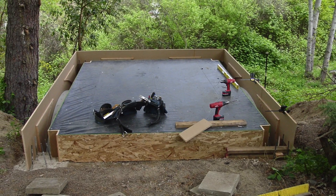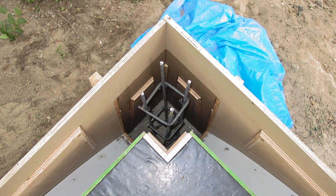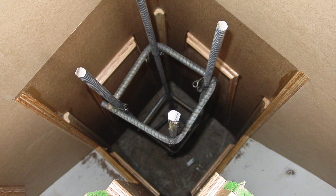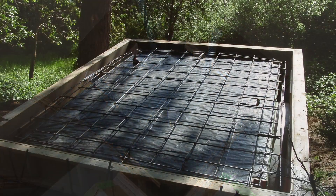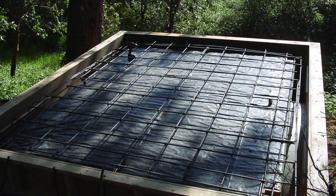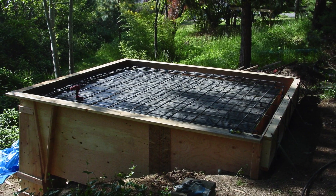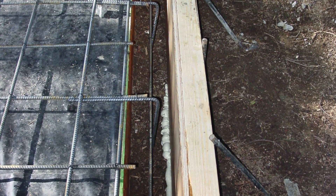We're at a point here where it's almost complete — just have to do the front portion. Here's another view of the rebar down the center of the pillar legs on the lower side. I had to make sure they didn't hit any of the panels, because you don't want the rebar coming out through the face of the concrete on the finished product. I used five-eighths rebar one foot on center, primarily to make it span over that deck without touching, because the underside of that deck will be visible and support blocks would show through.